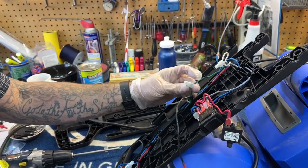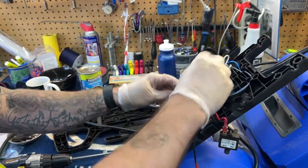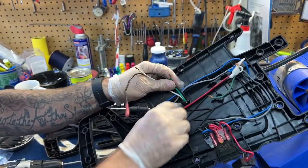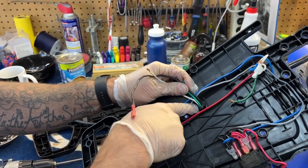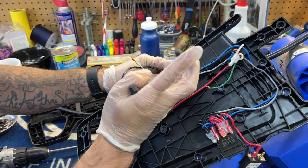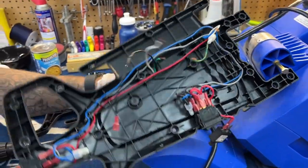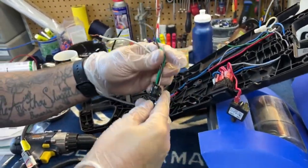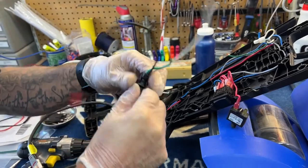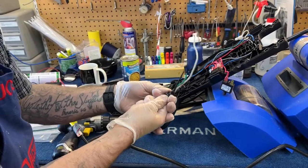And finally I have my ground wire right here. In the back we have where the cord goes in. We have this little doohickey here that kind of secures the cord. If you have the right size pliers, you can squeeze it and it'll pop right out. Then you'll see it's on the cord — this top part will pop out, and then you can pull that old failed cord. It's kind of stuck in there but it'll pull out.